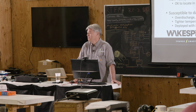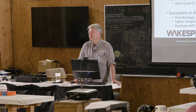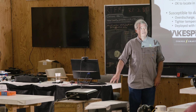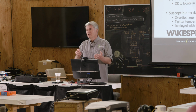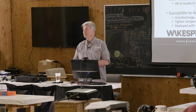Like, for example, I'll tell you a little sidelight story here. Have you ever heard the phrase that when you put batteries in storage, you should keep them around 40% state of charge? It's better on the battery; don't leave them fully charged. If you haven't heard that, go to the lithium battery manufacturers, and they'll tell you that. If you're not going to use your battery, keep it around 40%. If you leave it at 100%, it will degrade the battery quicker than if you store it at 40%.